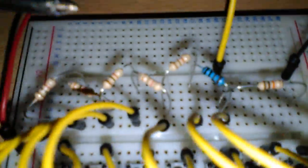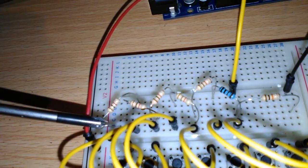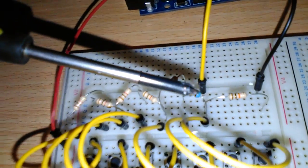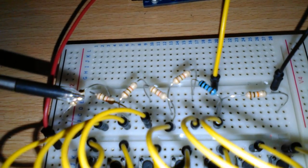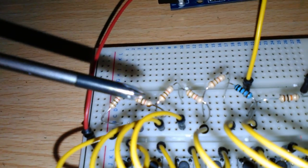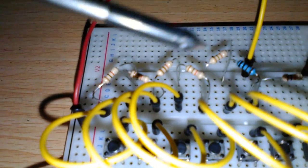From here, you've got your 10K and then six 1K resistors. At this pin, you've got 16K if you add that one onto it. But up to the yellow wire, you've actually got 6K, which then you use the pull-down to keep that low until you get a voltage going into that pin. So from here you get 6 kilohms — one input value going in. And then as you get nearer, the value gets higher, the nearer you get to this yellow wire, in regards to connecting these yellow wires up to each one of these resistors.